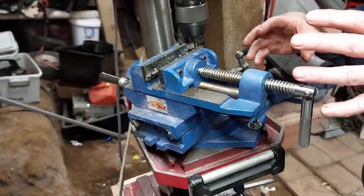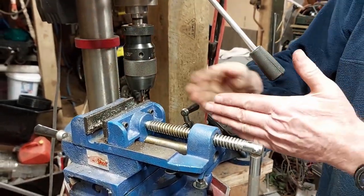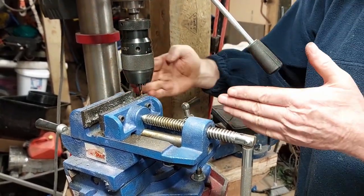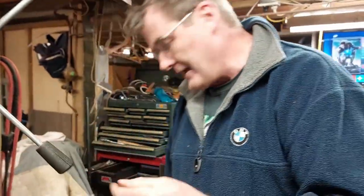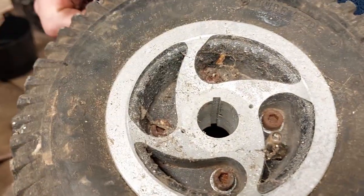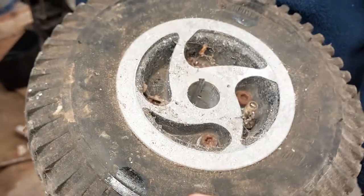I can't stress this enough - you've got to be very slow doing this, because the drill press has small amounts of movement and vibration, not like a mill which is solid. Take it very slowly, and when you move back and forward take your time, take a very small cut, check the width, check that it fits, until you get it right. The next video I'll do will be how to cut the next part - once we've cut the slot in the shaft, we cut the slot in the wheel, and then the key steel slides through and locks the shaft and wheel together.